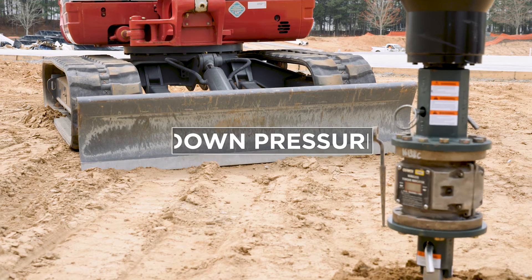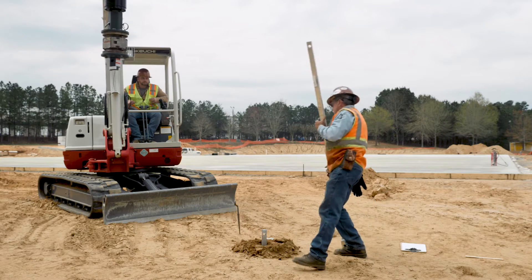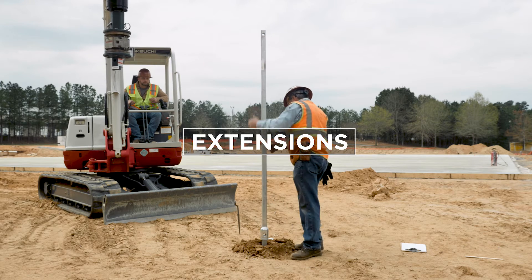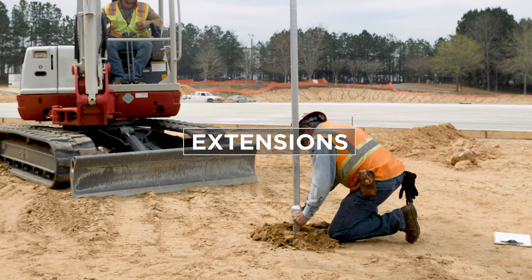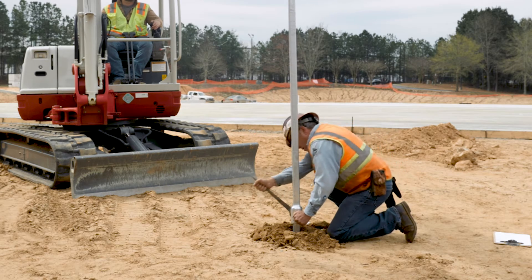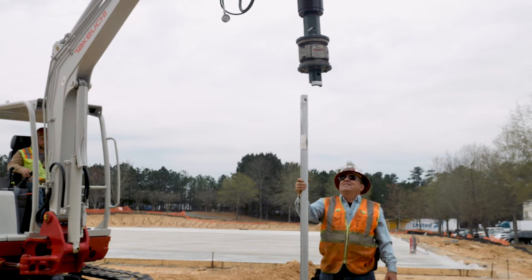To help keep the pile from spinning out, the machine needs to continuously apply down pressure to the pile. Square shaft pile extensions are added using a single bolt supplied with the extensions. Extension bolts should be tightened with the wrench a quarter of a turn beyond hand tight. Extensions will be added until the pile meets the installation requirements called out by the engineering documents.